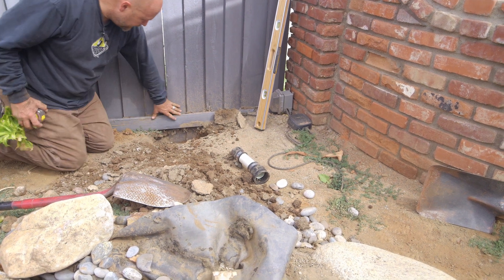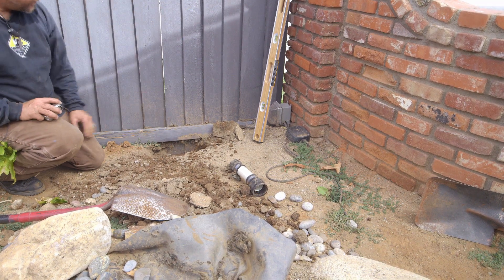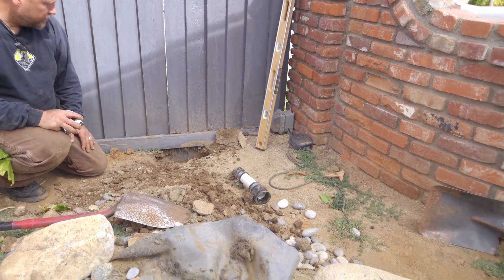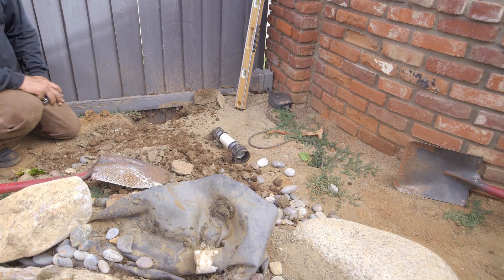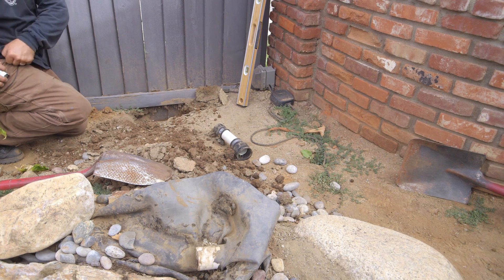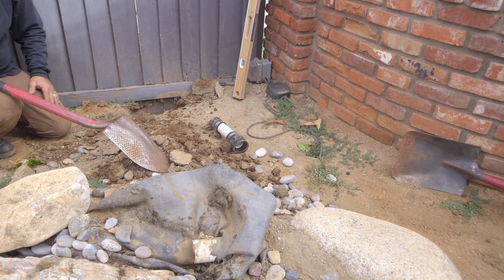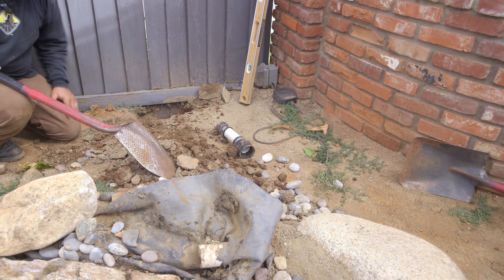You can see how the fence is already being compromised from dirt being on it. When you get dirt on there, moisture collects, and it also makes it susceptible to termites. Long term, this is not a good effect. This whole section should have been down — maybe not a complete eight inches, but definitely too much soil is against this fence.